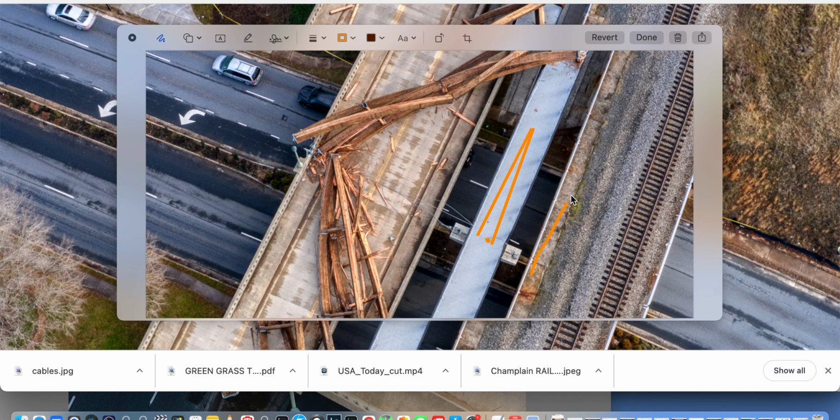Okay, so let's just do this. The whole thing just wants to fall over, or that way, it wants to fall over. So you need a distance apart that would be the proper distance. It's 40 feet tall. I don't know how wide these are apart, but you would need a distance that would be ideal. Now, even more ideal, what if you went a little bit further? And now further. Now you've got some good anchor points and this cable system. Now if it tries to pull that way, you've got this nice, more stable position.